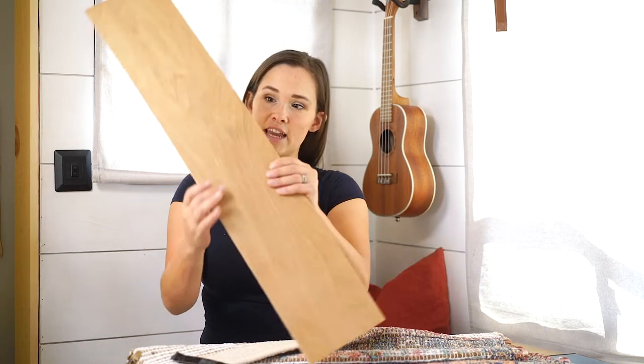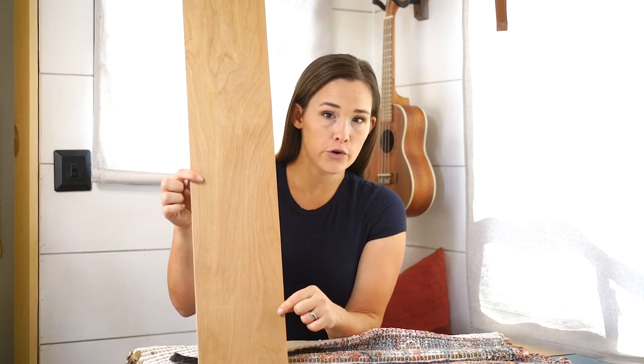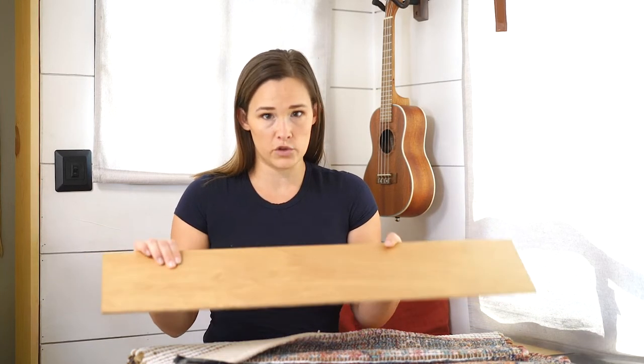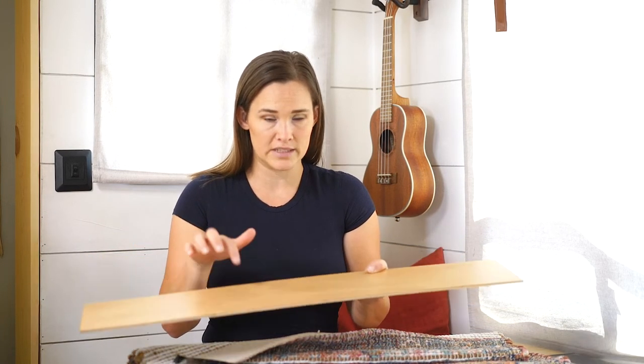This is just a six-inch piece of wood — this is how we make our faux shiplaps. You can paint it white. After you have the wood picked out, painted if you want, and finished with some sort of urethane if you want it to be easily wipeable and stain-resistant, the next step is to attach it to the wall.